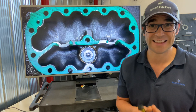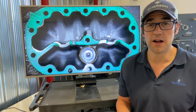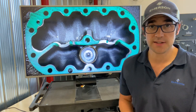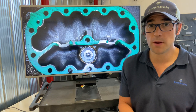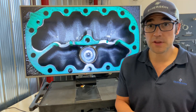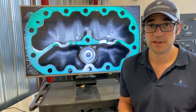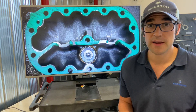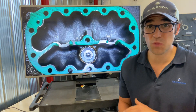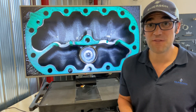This compressor was installed less than 30 days, and on the tag it said no valves. I'm assuming the technician put gauges on the system and seen the compressor was running but not pumping. So when Steve pulled it apart, he said nobody had inspected it — the heads weren't pulled off. And when he did pull it apart, he said the compressor was mechanically sound, it was perfect. The electrics were perfect, and even the valve plate was totally fine.